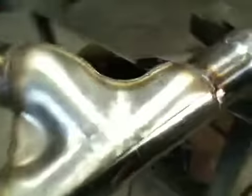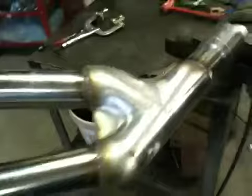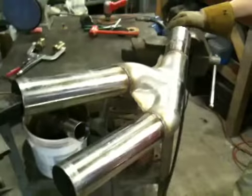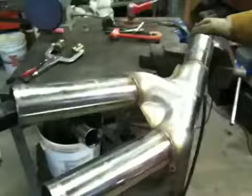Just do whatever you can to make it stay so that when you're welding it doesn't move on you. And we loaded the HTP MIG with some stainless wire to make this a nice clean stainless weld. There's going to be a lot more detail on how the system all comes together later, but the tip here today is just sometimes you've got to do whatever you can to make this stuff stay.